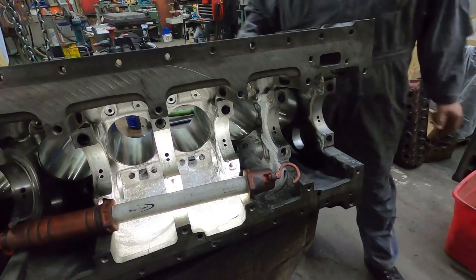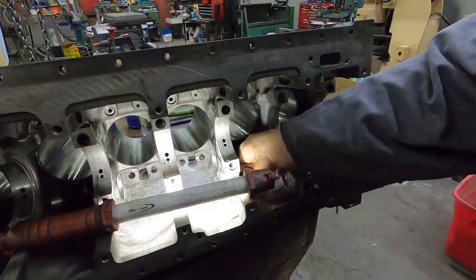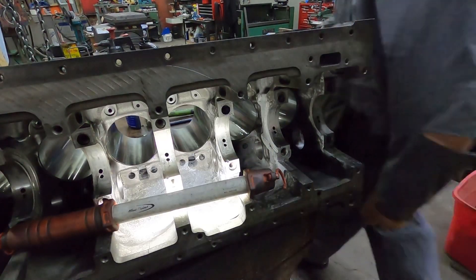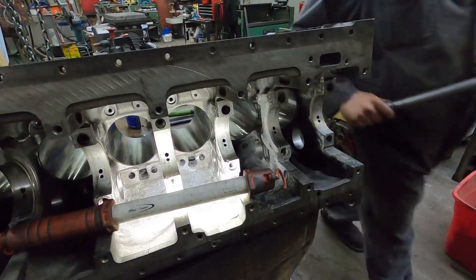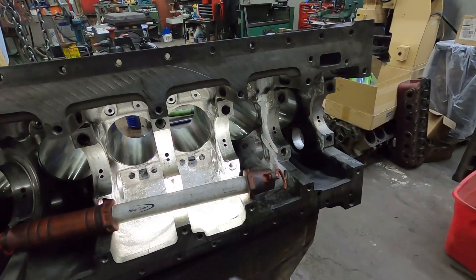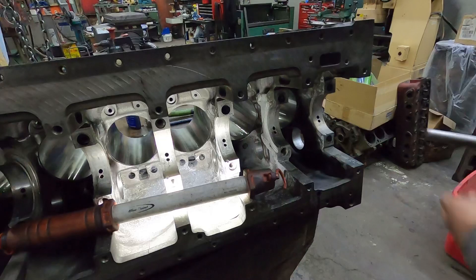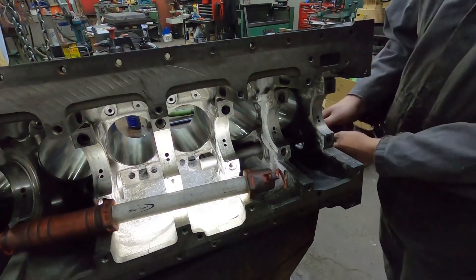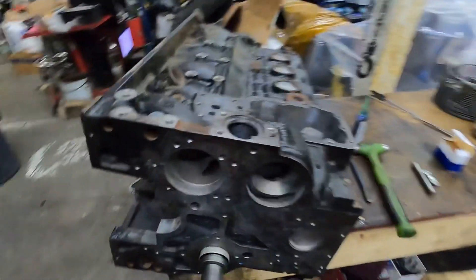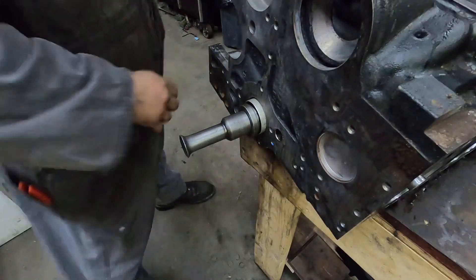You don't have to do it this way — this is just how we do it. There's this bushing that just has tape on it so it doesn't rattle around, because it wasn't actually the right size, but with the tape it works perfect for what we're doing. We have this bar with another one of these on there, and then you can hammer on this end. You install the bearing on this side, and basically all this does is keep the bearing straight when you're pounding it in.